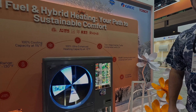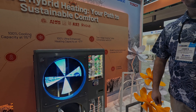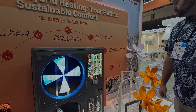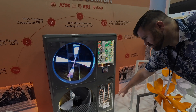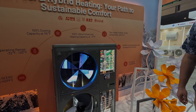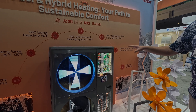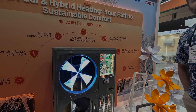That's great technology — it might actually be used in cooling mode too, because you need it to sub-cool the liquid refrigerant and manage head pressure. It's the same valve that does both actions, and that's what takes it to 130°F on cooling. Very nice product — if you like the Flex, you'd definitely love these. If you like HVAC videos and new stuff like that, like and subscribe and I'll catch y'all in the next one.